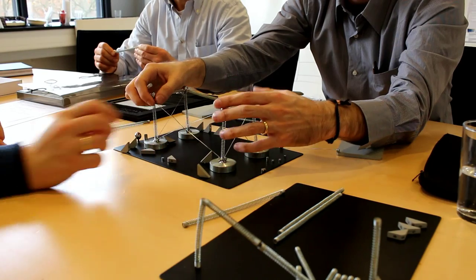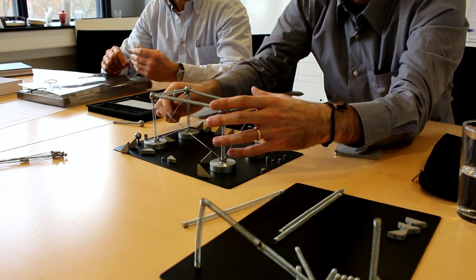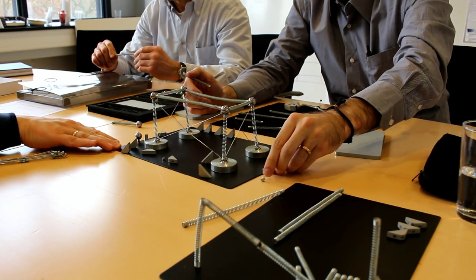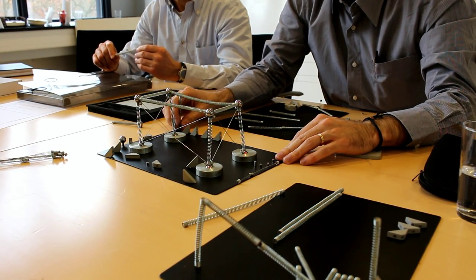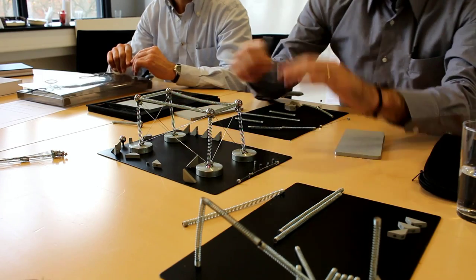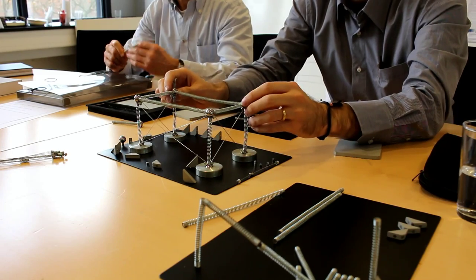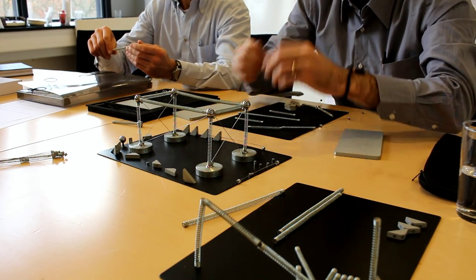We were also discussing whether this can be used for dynamic experimentation, so that you can have this principle on a small shaking table, so you can just see how it works, how eigenfrequencies. I received an email from a Brazilian student who is in Japan, and she wants to try it. Do you have in your models the stiffness, if you use this bracing here? Do you know the rotation stiffness for your models? No, no numbers. It would be nice if you want to make a model. You can also make an exercise determining it, like the finite element we just talked about. You have these functions and you make a displacement, you measure the force, and then you can determine the spring stiffness for rotation, for elongation, and so on and so forth.